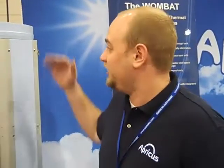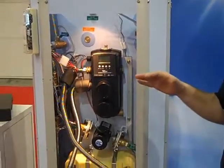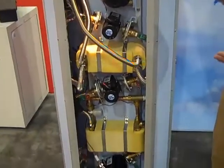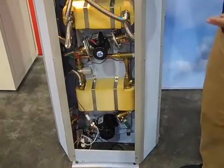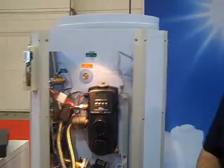What that is: there's no pressure inside here, it's a dead water tank, and we use that thermal energy from solar and a tankless water heater to provide energy for the home's space heating and domestic hot water.